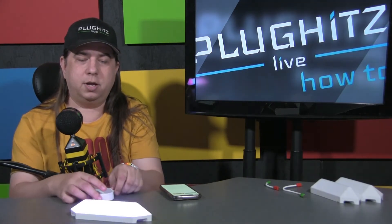We're going to take our power, plug it into the controller, and one of a couple of things will happen. It will either turn on blinking — if that's the case, ignore this next step — it might come on in a solid color, or it might come on to a scene like what you see here. We're on a scene right now, which is not what we want. We want it to be blinking. So what we do is press the power button for about 10 seconds and the light will turn off and then start blinking green. Blinking green is what we want to see.